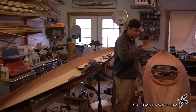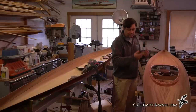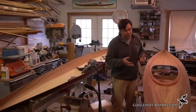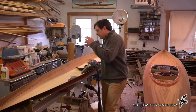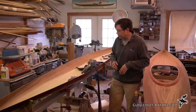And for strength, the rest of the deck interior with S-glass, I have the S-glass, it's stronger than the E-glass. I don't care about the clarity as much on the interior. So I'm still thinking about it, but I might go with the S-glass on the interior at the ends of the boat, carbon fiber in the middle, carbon Kevlar interior on the hull, and see how it looks.